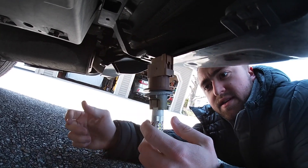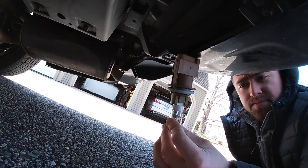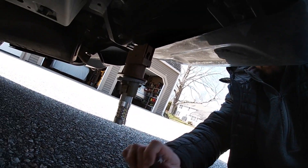And then plug the new one in. Make sure it's secure. We're going to test it before we put it back up because LEDs mainly work one way. So if it doesn't work, you can just flip it around and it'll work. So let's test it out.